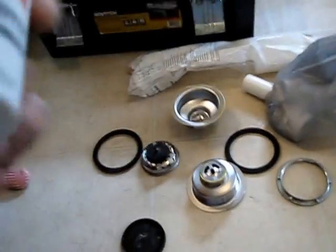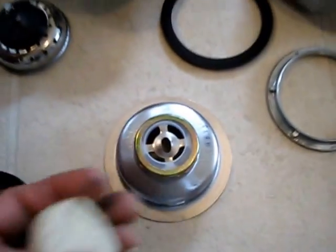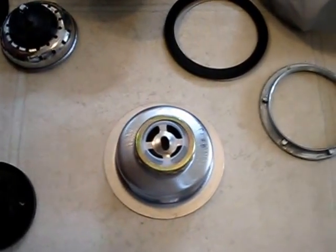The first thing you'll need is plumber's putty. Plumber's putty is going to go around the bottom of the basket retainer, which will be in this area here. Just knead it up in your hands, get it so it's real soft and real pliable. It'll warm up — roll it into about a half inch circle.